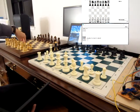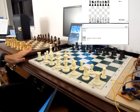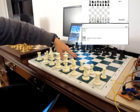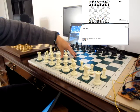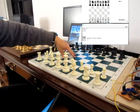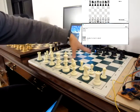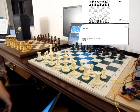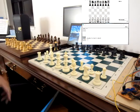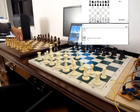Whenever the DGT board gets confused, it generates a new PGN file. My board is designed for scholastic, young scholastic player tournament play. So sometimes people make illegal moves, and after a couple moves they realize it. So they'll move backwards, and I have intelligence in it to handle that. In order for it to generate a new PGN, I just tell it to reset the program. It has non-volatile memory that records the PGN, so the previous PGN is already recorded, but now it's a new game. So let's get started — it's D4.